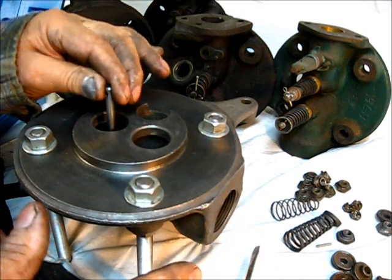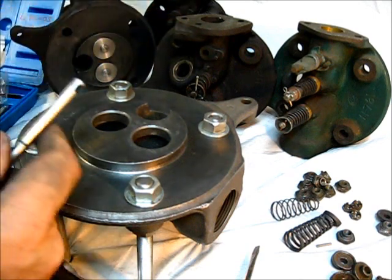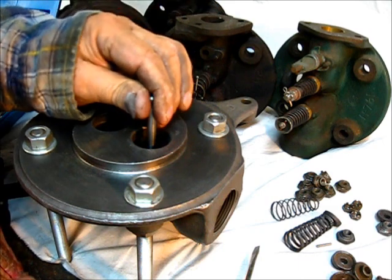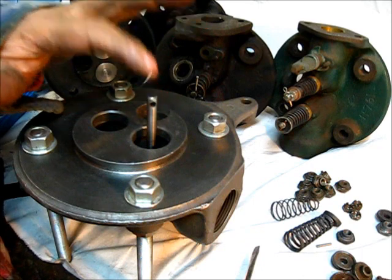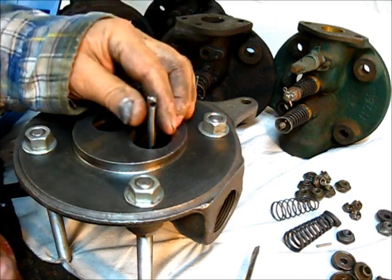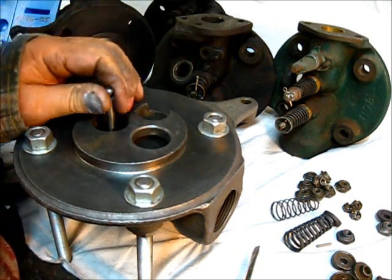The bottom size of the pilot is two hundred ninety seven thousandths. That is the system I'm using today. When you put the pilot into the guide — the three eleven — it's a real good snug fit, no play whatsoever. If you have a pilot that's loose in there, you will not have success cutting; you'll have chatter. This three eleven pilot works in both of those guides.